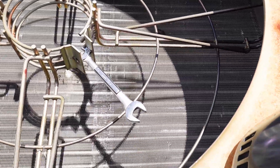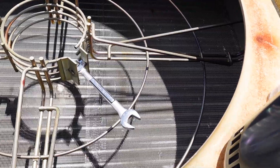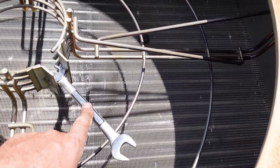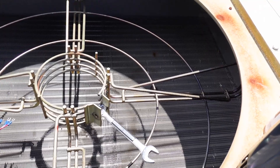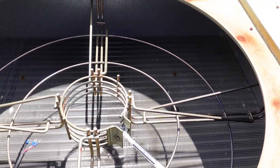You can also see this belly band. These things can fit pretty tight, so what I've done — using a 5/8 wrench — is I got it in there and used another wrench to flip it, so it's spreading this belly band apart for me. Now it's like a one-handed operation — just let the motor slide down into the position you want.